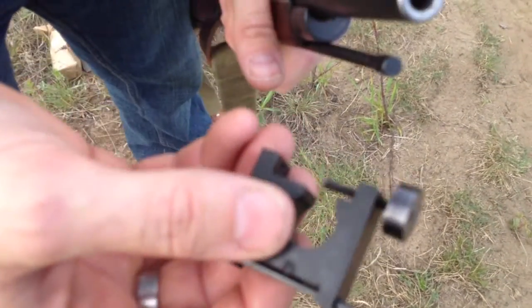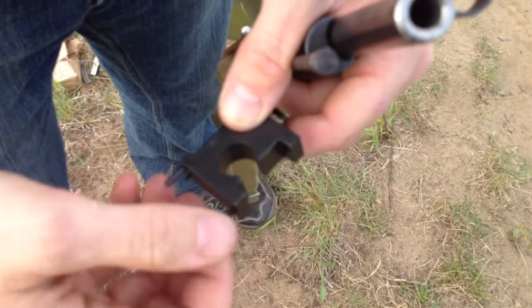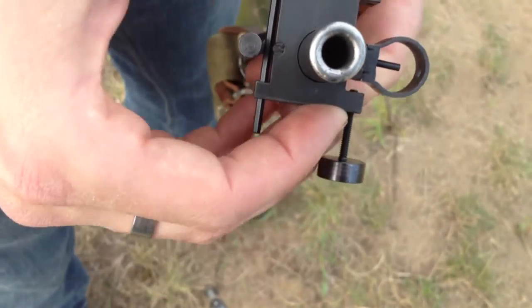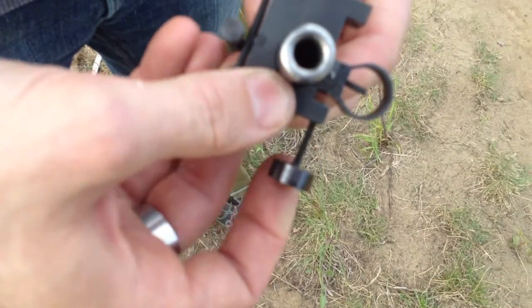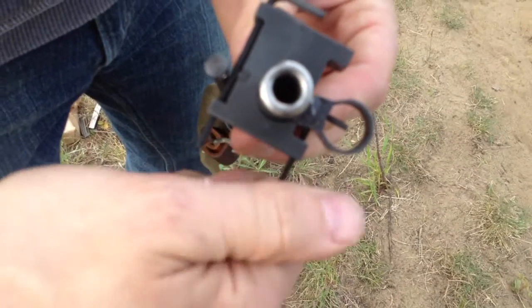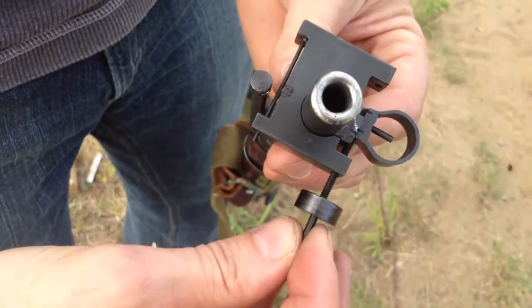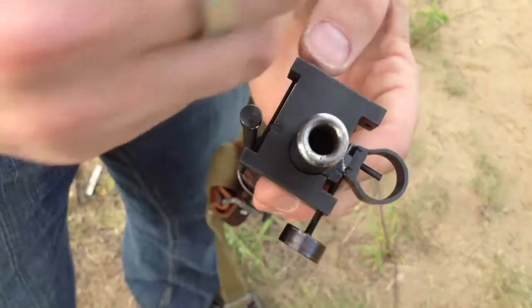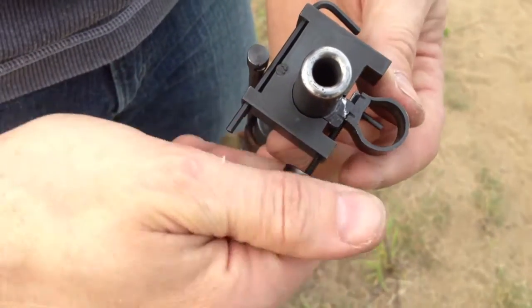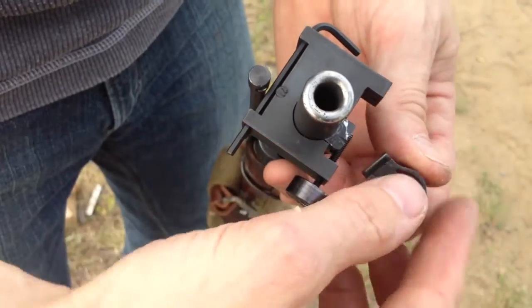So the way this is used, you can use this to remove the original sight. You wind this screw out. This just fits over the barrel right here. You don't even need to remove the cleaning rod — there's enough clearance in there — and you can just wind this screw in, and that will push the sight all the way out. Now if you've got a really stiff sight, this Allen key will fit a hex head right there. My sight is not all that tight, so I can just do it with my fingers, and that's going to push this sight all the way out — and there you go.